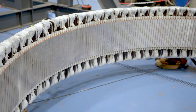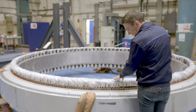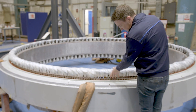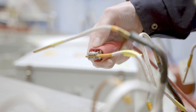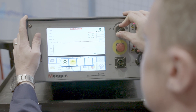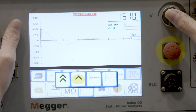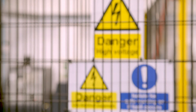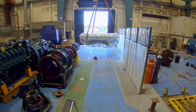We have a testing capability of up to 40 kV, so we've tested this machine rigorously at the end of its rewind process. The rotor coils we've tested at ten times operating voltage, and the stator we've tested at twice line voltage plus a thousand volts. Performing this kind of testing in-house means that the customer has peace of mind that it's definitely going to run at operating voltage. We've proven it can take way above operating voltage, so it gives the customer confidence that it's going to run for a long time and that we've given them a quality product.